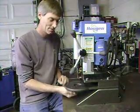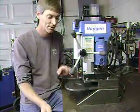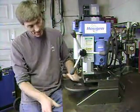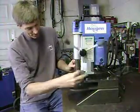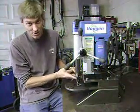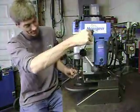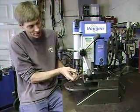This center line should be the center line of the hole. I have a two and seven-sixteenths inch hole here because my machine can drill up to two and three-eighths, so that gives it clearance. This distance is set up at an inch and a half because that is the maximum my bit will go. My machine has a one-inch additional piece in the quill that I can remove and put a two-inch cutter in, which takes up the difference.